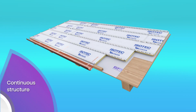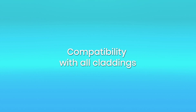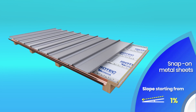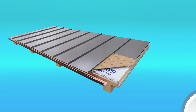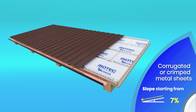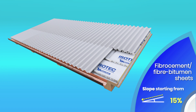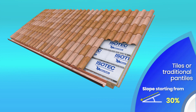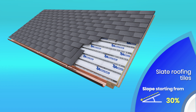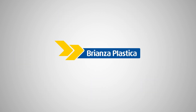The ESOTech panel can be installed on all types of structures, both continuous and discontinuous. The panel can be installed on different slopes depending on the type of cladding chosen: starting from a slope of 1% in combination with snap-on metal sheets; from 5% with standing seam metal sheets; from 7% with corrugated or crimped metal sheets; from 10% with specific tiles for low slopes; from 15% with fibro cement or fibro bitumen sheets; and from 30% in combination with traditional, special or slate tiles.